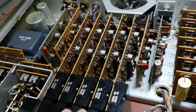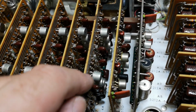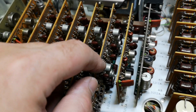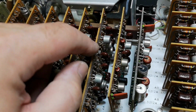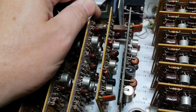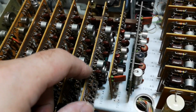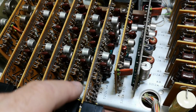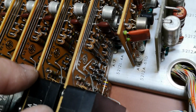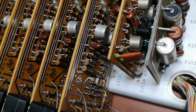So this one can count to 10. So how is that done? This is done. Ooh, I see what I see. They have stolen the same kind of counter ideas. So you got 4 and we got 4. They're probably doing exactly the same as their older equipment with the neon bulbs, and this is like Charlieplexing, and then they go to the Nixies. Oh, that's probably what we see. And we've got some diodes here to make it into a Nixie kind of drive style. Oh man, I love it.